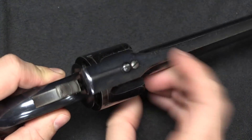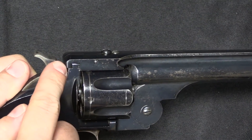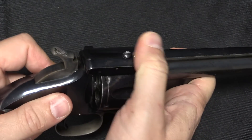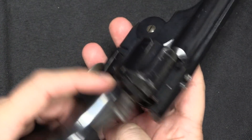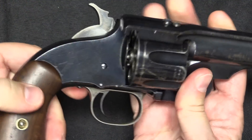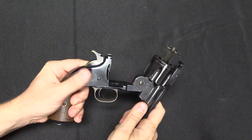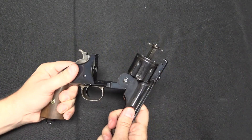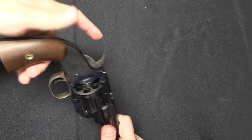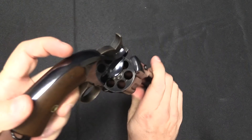This experimental revolver has a different style of catch — a spring-loaded latch. Wesson's patent specifically says that the exact mechanism of locking the frame together doesn't matter, as there are lots of possibilities. Once you unlock it, you actually pivot the barrel off to the side. The frame is cut right there, and there's a pin that allows it to pivot. Then you can open it up like a traditional No. 3. There's no spring in here, so the extractor stays open all the way. This would extract your cases, and then you bring it down, which closes the extractor, and then you can load cartridges one at a time with the cylinder swivelled out to the side. Once it's loaded, you lock it back in place.